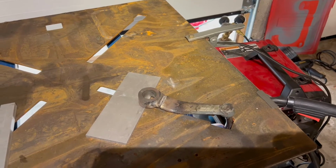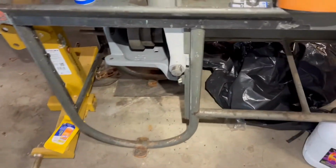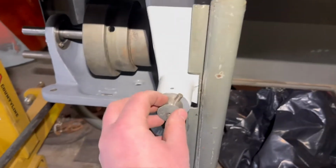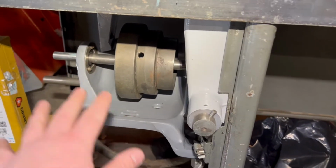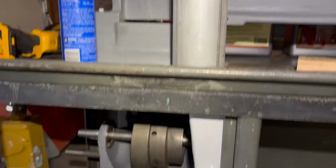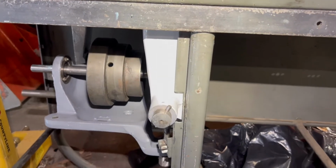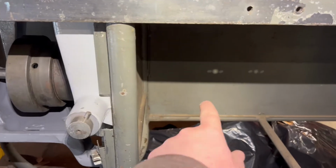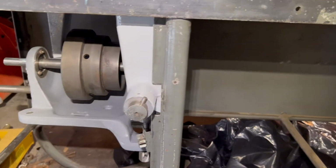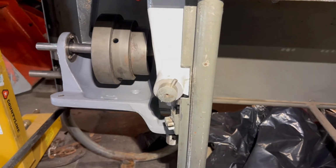So I'm going to jump into it now, and just to clarify, this is for this shaft here, which rotates the cradle and lets the cradle go up and down to tension the belt that goes into the headstock. Why it originally broke is the previous owner dropped it, the lathe rolled forward, and it broke the handle off, and it went that way. They brazed it. I got all the brass off, so we'll give it a shot now.